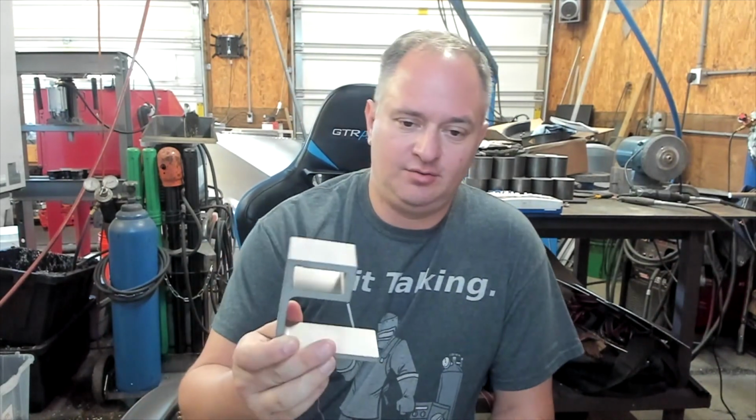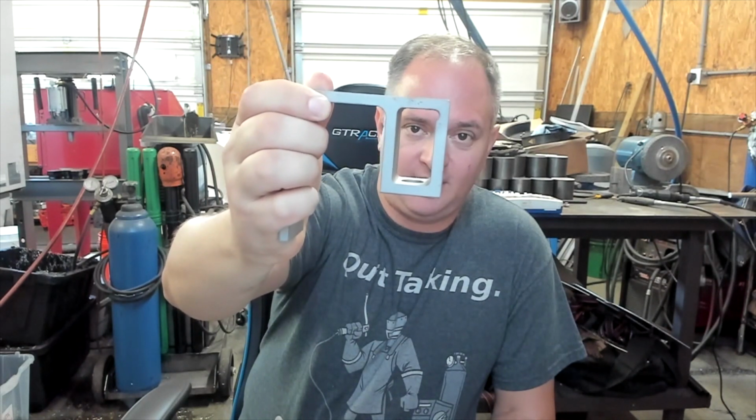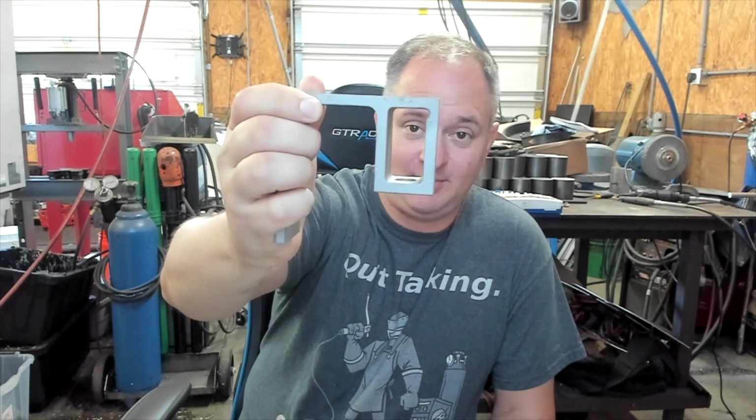I needed to do a pre-drilled hole. And actually, this is what happens when you measure off of the radius and calculate diameters and forget to keep it consistent. So when I pre-drilled that hole, it was off. It was on the center of the part and not accounting for the diameter. Oops, made a mistake there. But it still worked out fairly well, and this is going to be fine for what they're using it for. I made sure there's no stress risers in there. Everything is good, so that part's okay. But let's take a look at some of the video that we did.